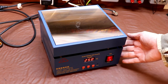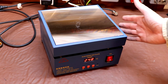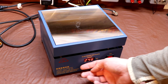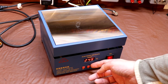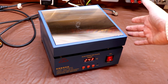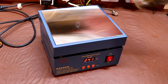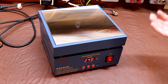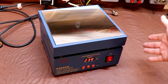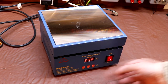The hot plate heated itself to about 300 degrees and I switched it off a few minutes ago. You can actually see that there must be an awful lot of thermal mass in the top aluminium plate, because even though the watt meter isn't showing any power at all, the temperature is still at about 245 to 246 degrees, and you can see how slowly it's falling. My room is actually a bit smoky and smelly — there must be some preservatives and lacquers on the underside of the hot plate burning off for the first time. The top of the unit is uncomfortable to touch; you would definitely burn yourself. The lower side is also quite hot but not unbearable — a piece of equipment like this you need to treat with respect.